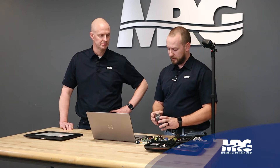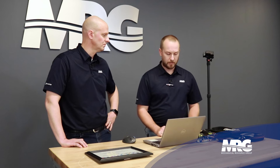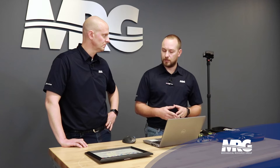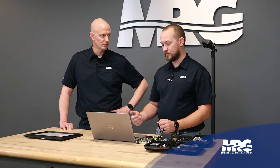A really common question we get is from technicians who completed the proper courses but a year or year and a half later haven't had the opportunity to actually use the service checker, so they call and ask to be walked through setup. The first thing you want to do is identify where you're going to terminate the communication cabling. If you have a single system without a central communication platform like an iTouch Manager or iTouch Controller, you can connect directly to the board — but it's often much easier to connect at the iTouch Manager or iTouch Controller.